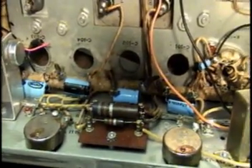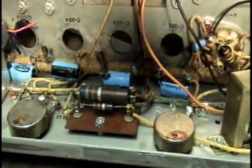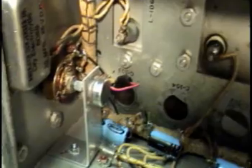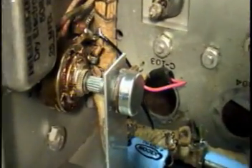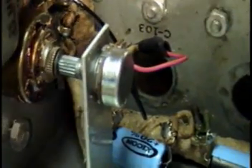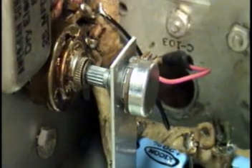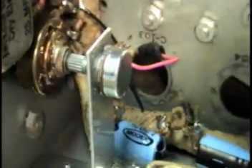Real quick — bottom side. All the filter caps in this thing were leaking really bad, so I substituted them out with these nice little 4.7 microfarad 450-volt caps. The gain control was broken — it was a stacked pot type, which is impossible to find — so what I did is I coupled in another pot and just utilized the shaft sticking out of the old pot. It works like a million bucks.